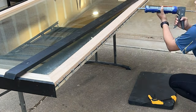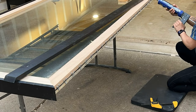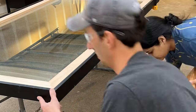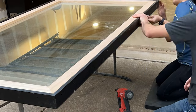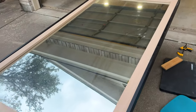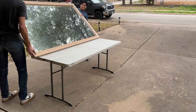My biggest tip here is to go slow with the nail gun, because if you angle it wrong and it nails into the mirror, it could crack it and totally mess everything up. You want to make sure the nail gun is aimed perfectly so the nail goes through the black piece of trim and into the oak piece of trim. It's not that complicated, but I just want to give this disclaimer before you try this part of the project.